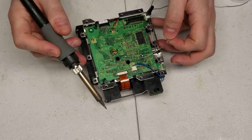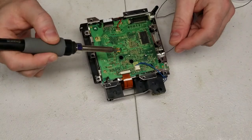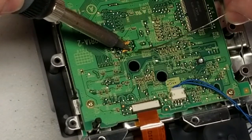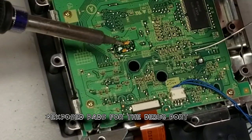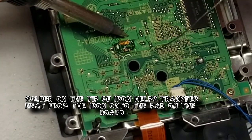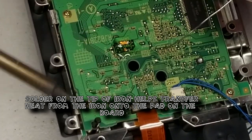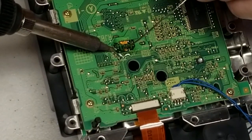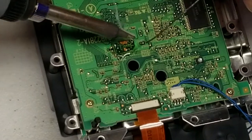I'm going to put up a diagram so you can see the exact solder points you need to hit. You want to add flux and add some fresh solder to each of those points. Three of those points are just exposed copper, so you want a little bit of solder on the tip of your iron, bring your solder in, and touch it to another point on the copper — the copper will absorb the solder from the actual solder, not the soldering iron itself.